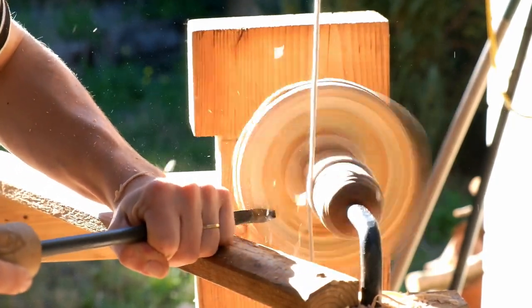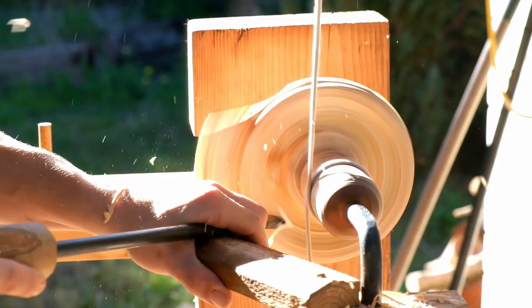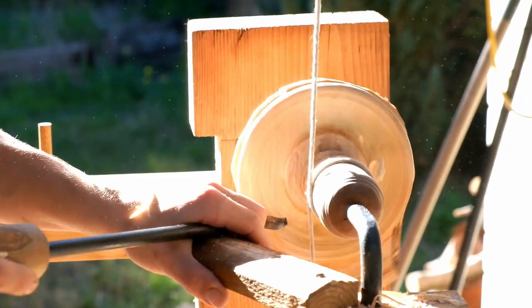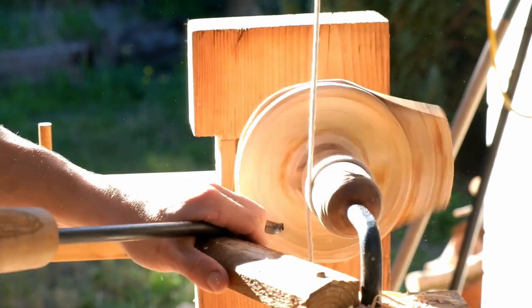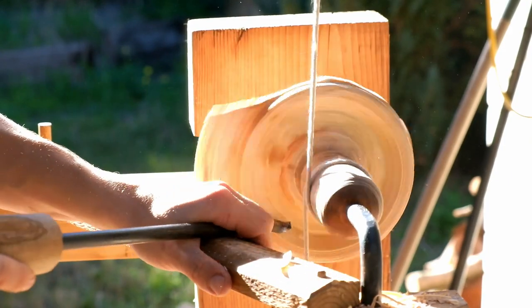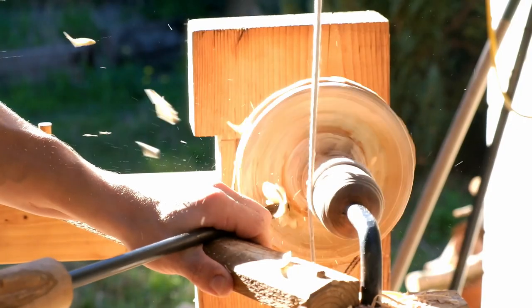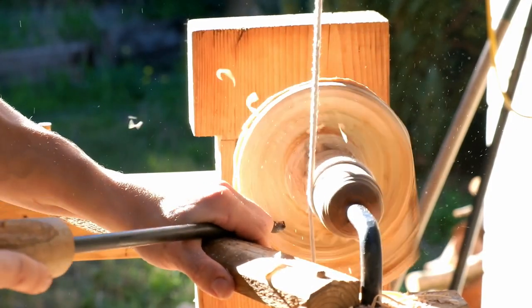The shavings I'm taking are good but I'm not getting the kind of smooth cut that I expect. It's the stability of the tool that is not there — it's definitely sharp and the edge geometry seems correct but it's kind of jumping around in the bowl. The contrast is going to be really clear when I show you the other hook in terms of just how much additional stability there is from the extra mass of the material.